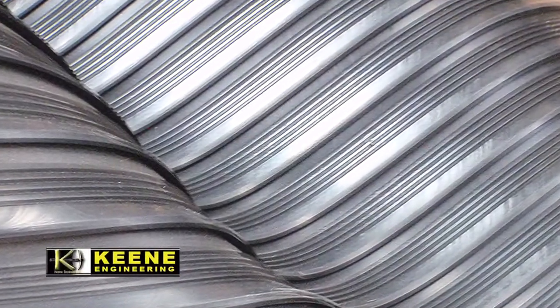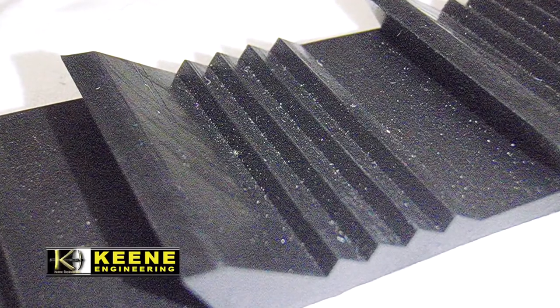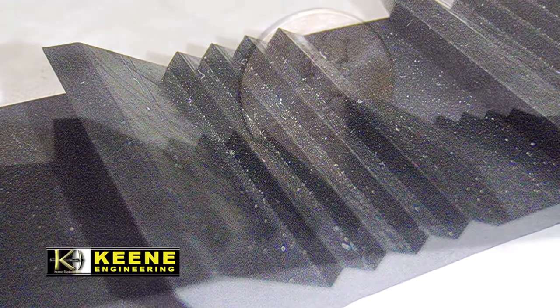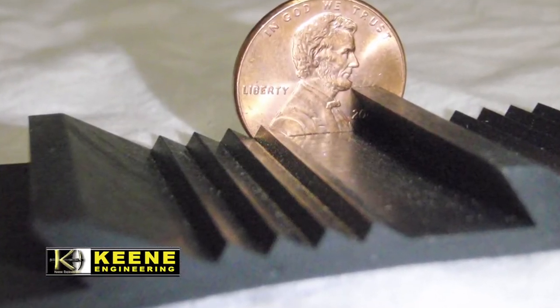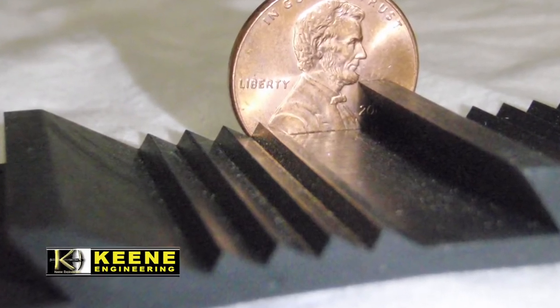We've been experimenting with this box over the last couple of years in Alaska. My friend Bob has also been working on our new rubber riffles and putting them through the test to make sure they can handle the garnet sands, because garnet sands are really difficult to separate, since the specific gravity of the garnet, I think, is about 4.5. The iron's generally a lot smaller, and the black sand filters out. But with the box this wide, it's pretty hard to get rid of any of the black sands.